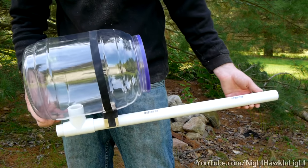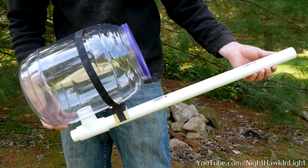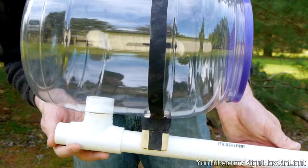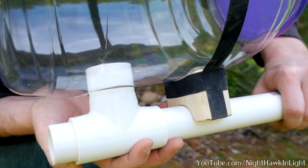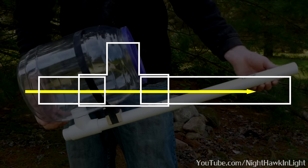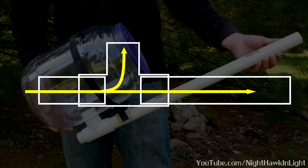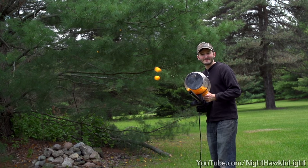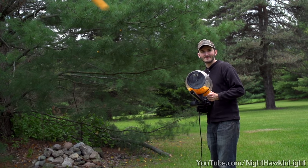Here is the barrel without paint. It's assembled with several lengths of 1-inch diameter PVC pipe with a T-fitting connecting to the hopper. Under normal conditions, if air were flowing through this barrel, most of it would exit the far end, but some of it would be redirected upwards through the T. This is bad news for feeding ammunition because this upward stream of air would be actively fighting against cheeseballs falling into the barrel.